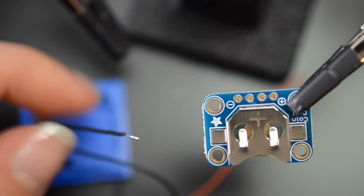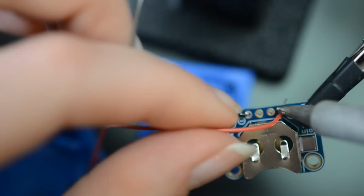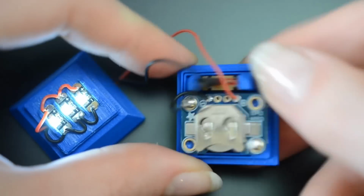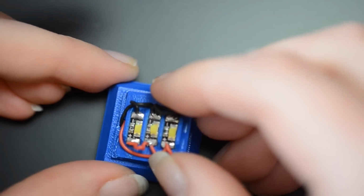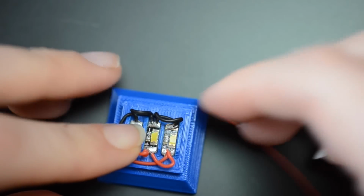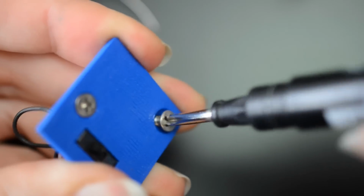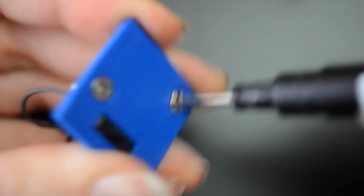Run wires through the base and over to the coin cell battery breakout and switch. You can find the tutorial and circuit diagram for this project at the link in the description. Test it out, then use some E6000 glue to stick the sequin plate in place. This stuff takes a while to dry, but it makes your pendant a lot more durable than plain old hot glue. Assembly does not require a sonic screwdriver. A regular Phillips head will do just fine to attach the battery holder to the base plate.